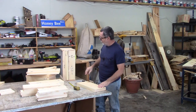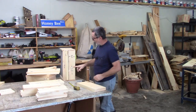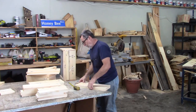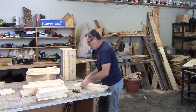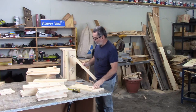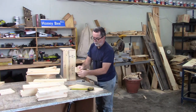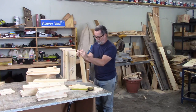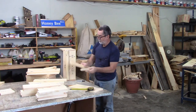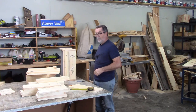Next I need to rip this piece for the back. These boards are seven and a quarter by eighteen and a quarter. For the front they stay the full width, but for the back one we need to knock it down to four and an eighth, and the piece left over will create the little door. I just measure over four and an eighth, mark it, and very carefully knock off the sawdust. This piece ends up being two inches — it's a little bit trickier to cut, but you mark it two inches. The piece left over will make the handle. When you've got a small piece like this you've got to get a good firm grip — that's definitely a little harder, hard on the hands too. This piece that's left over makes the handle, this piece makes the door, and this piece goes there. A couple more to rip and then we'll get on to the plywood next.